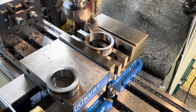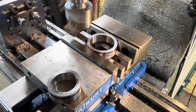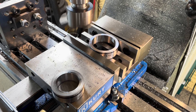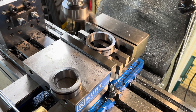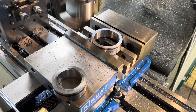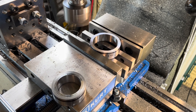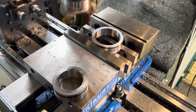Making the spacer rings for my first super precision bearing pack. The key element here is they have to be as close to exactly the same dimension along the axis as possible — the same thickness along the axis. I'm doing that with a fly cutter, just taking off a couple of thousandths. And without changing the setup, I'm going to run the second ring through.